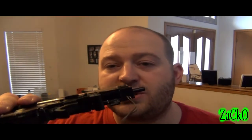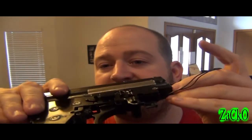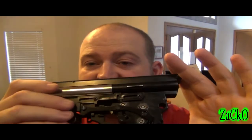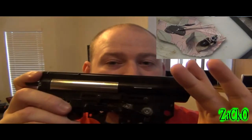I was talking about switching out the micro switch. I've made my own here, glued it in. Now I'm going to talk about the new things I've discovered in the last few days. I know this gearbox inside and out and I'm just about done. I'm waiting for the cutoff lever which has JB weld on it — it's not thick enough yet, so I need to put some more on and cure it, then shape it down to fit for semi-automatic.